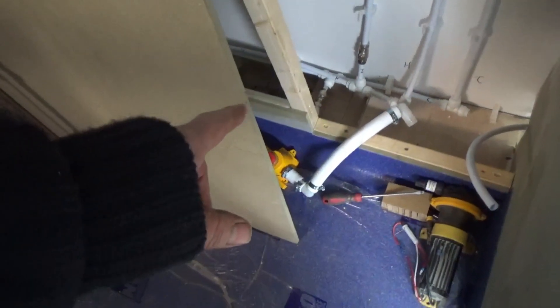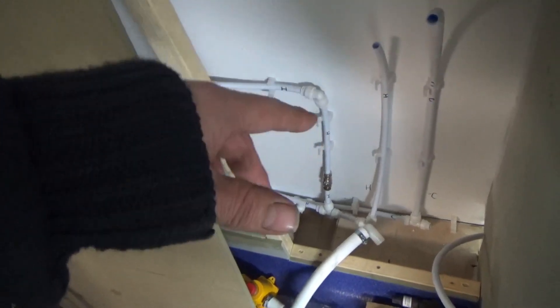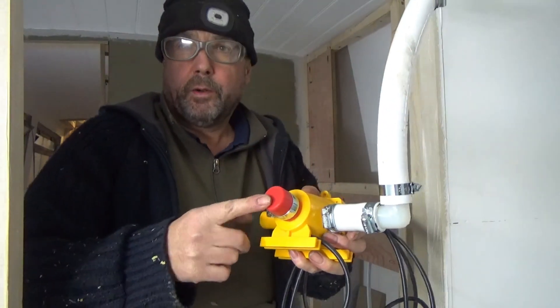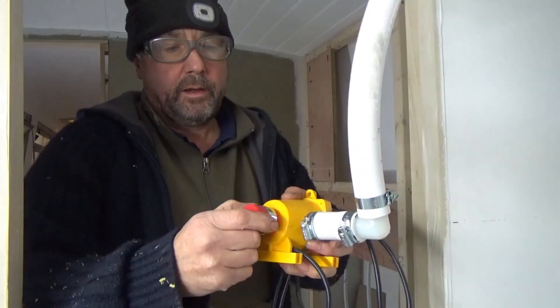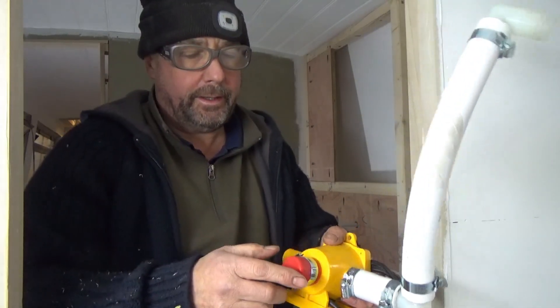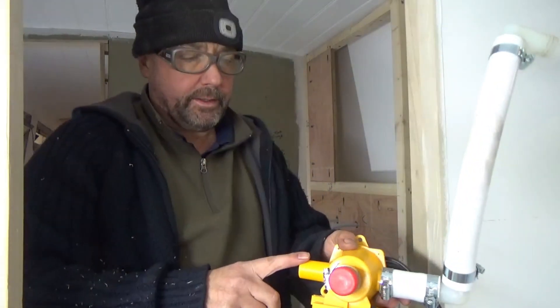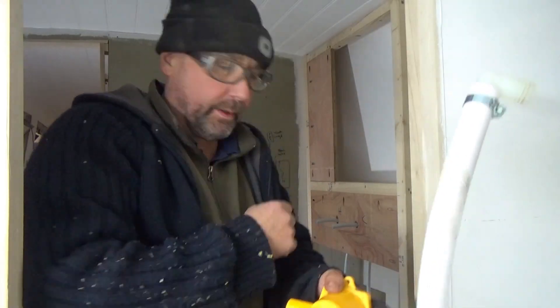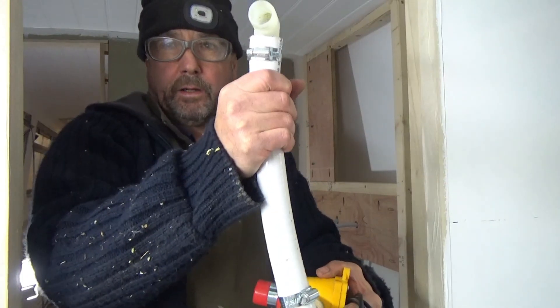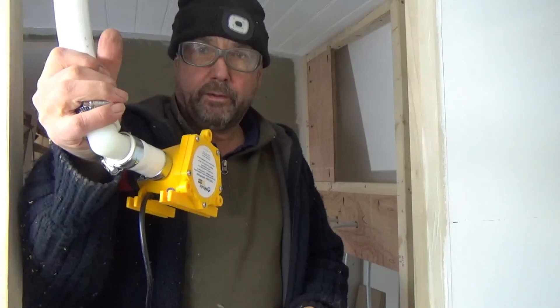What we can do now is finish in here: put this pump in and all the hose on, so that'll come up ready to be taken outside. I've been waiting for these silicone blanks from an automotive shop — they stand up to 180 degrees, so well above anything from the shower. We're blanking off that port since we're not using it. That one needs putting onto the shower pipe coming out of the gully there, and then that goes up to our shower pump. We'll get this in and that's out of the way.